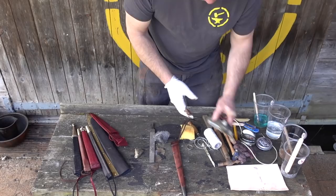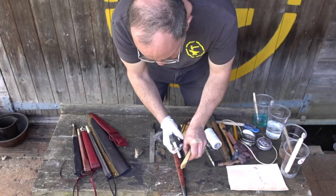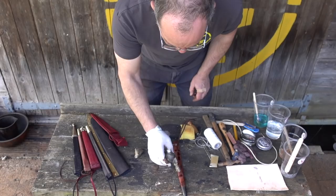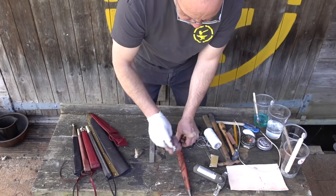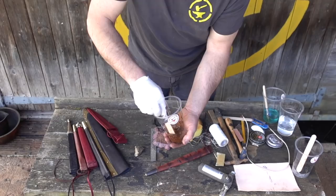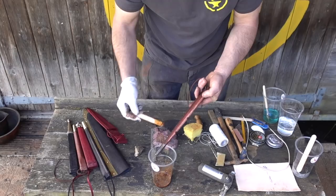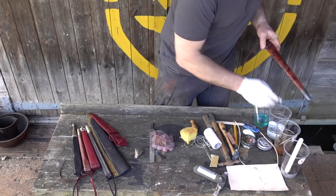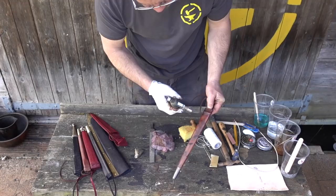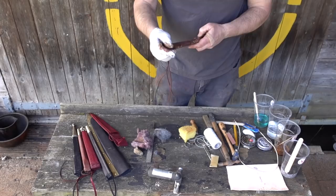A bit of wire wool, get rid of a couple of fluffy bits. Then he was eating his roast chicken again one night and some fat ended up on it — so that's just a bit of beeswax melted into the surface and then rubbed back. You can see you're beginning to get some life into it. Adding some instant coffee now — this gives a slightly more matte, duller finish and fills into the corners a bit. Some bits will take, some won't. This chap, he's gotten into a couple of fights, he's a messy eater — and I think we're going to leave this guy there.